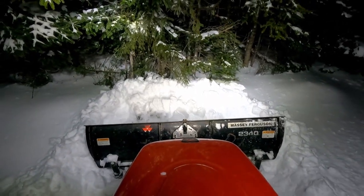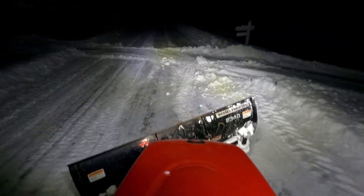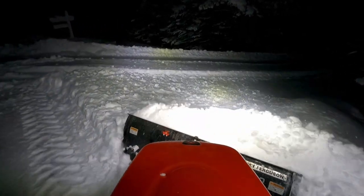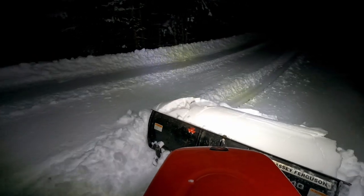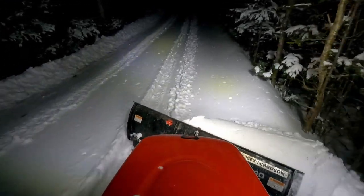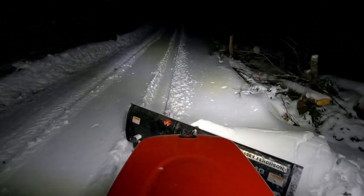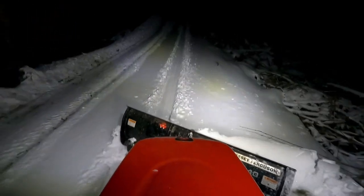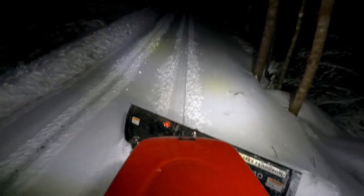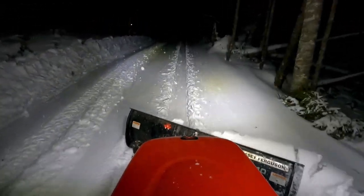So we push that right across the road. I'm going to come around now and get set up, and then I'll make a run in on the other side — so I plow both of the banks first. The reason I do that is because as the snow builds up it makes big snowbanks, and it's hard to get the snow to go over the snowbank. So I find when I plow the edges first, then I can set the width of the lane. And then I'll come back and do the center part — run out and back in to do the center, then go out and back in again and do the edges, just to make sure the snowbanks don't get so big that the drive might start to narrow up on me.